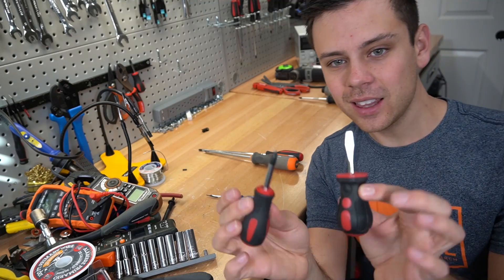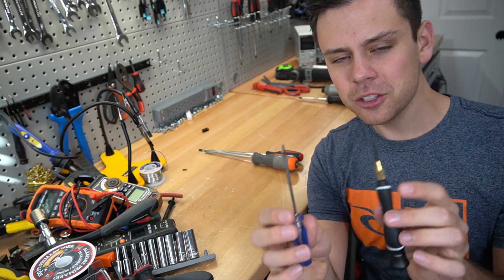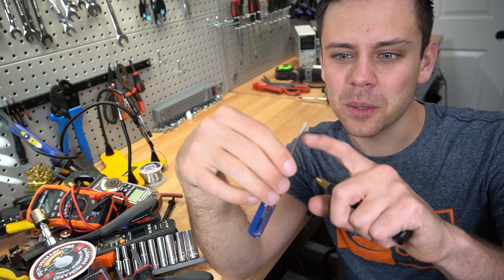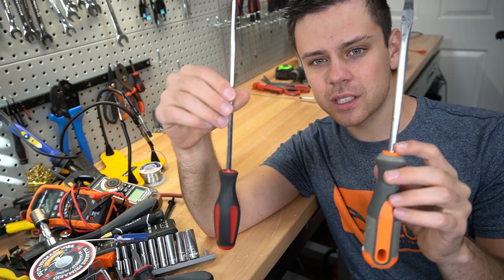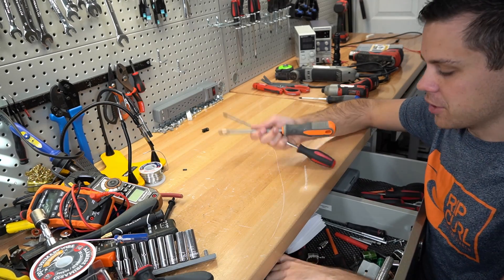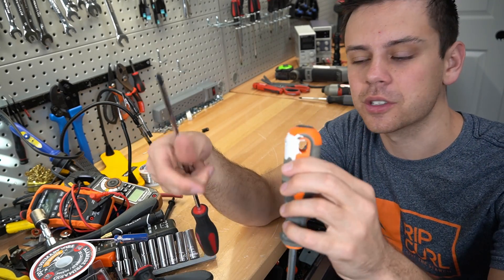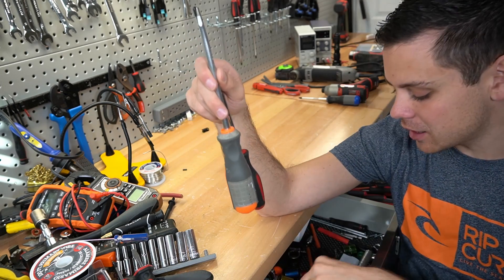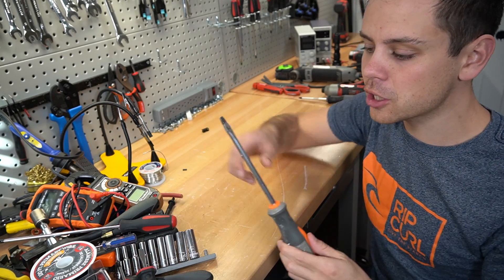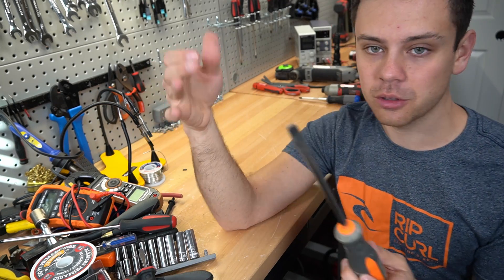The next tools are the screwdrivers. I like stubby screwdrivers, especially for inverter cases and terminals. You also need some high quality but small screwdrivers — I have used one for almost every solar charge controller input terminal on the market and it just grips so nicely. Next you need some long screwdrivers, preferably insulated. I like certain ones because the heads really grip the screws and the flathead is really strong — I can use it with hammers. But if you need an insulated one, be sure to buy one — these are very important for higher voltage or when working with battery terminals. You could also buy a high quality normal tool and add heat shrink or electrical tape to turn it into an insulated tool.